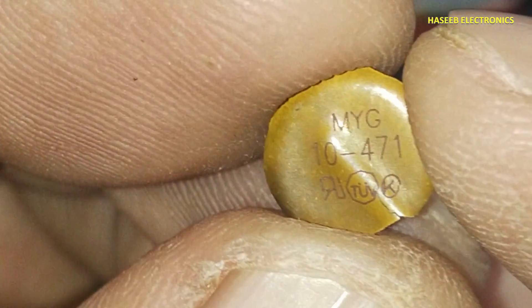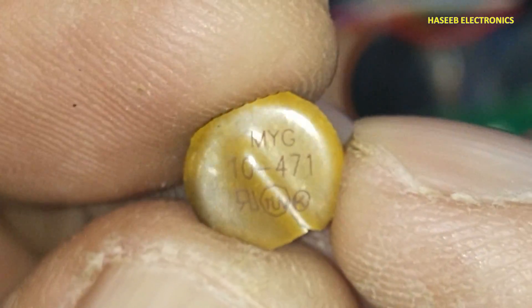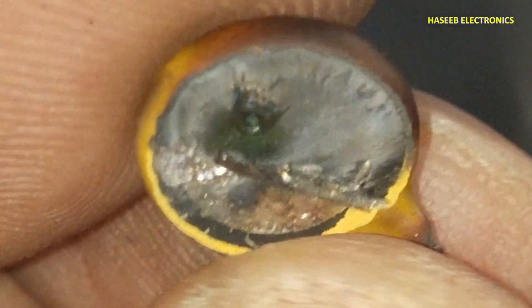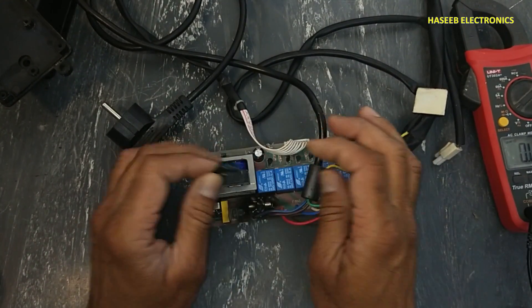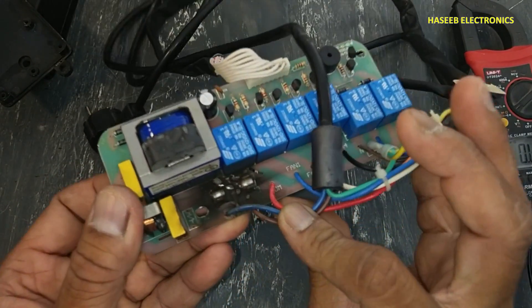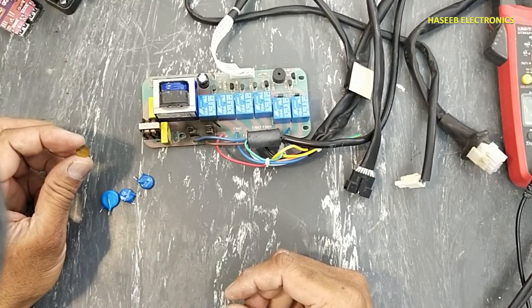The '10' is the chip size and 470 volts is the rating, so its clamping range is normally 420 volts to 520 volts. This fuse is also damaged very badly — it is a 6.3-ampere fuse.